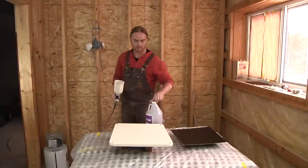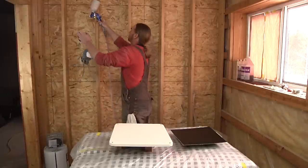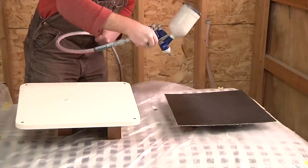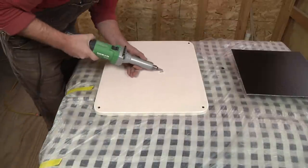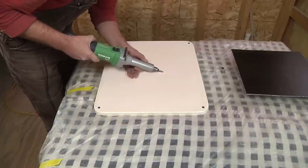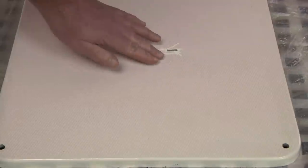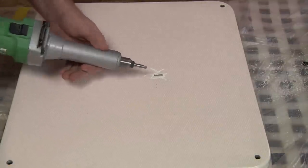Now, just as before when we were making this mold, I'm going to treat both of these surfaces with four light coats of PVA, or polyvinyl alcohol. Now you may be asking yourself, why am I spraying PVA directly over the area that I need to fill with gel coat? I mean, it's not going to stick, right? Well, there's a reason. By coming in and spraying everything with PVA and then grinding it back out, I'm going to be able to ensure that the gel coat is only going to stick exactly where I want it.